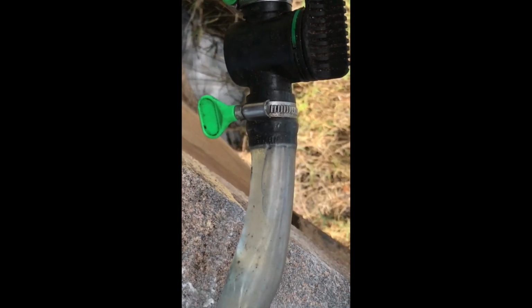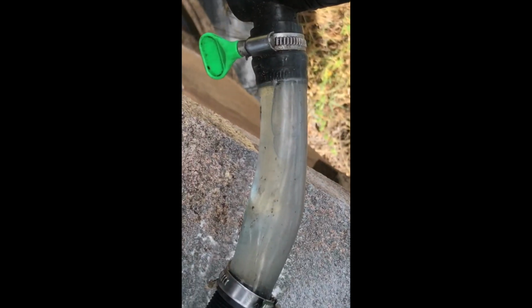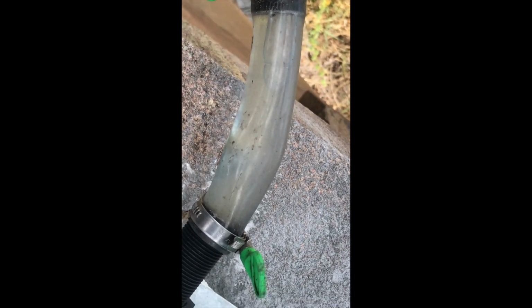So now the gel is being decanted. If you look in the clear extraction hose, you can see all the rust flakes traveling along. And all those rust flakes and debris have come from the internal of the bearing. And this is an area where you couldn't really clean it to this degree. You couldn't de-rust it without submerging it in a bath using a gel like our product.